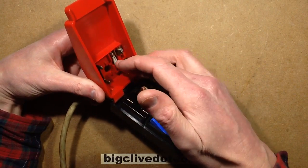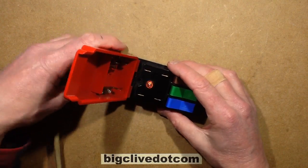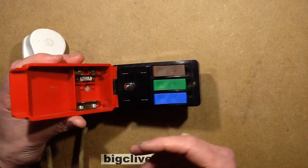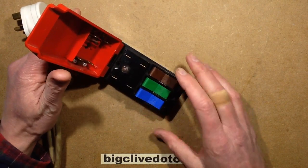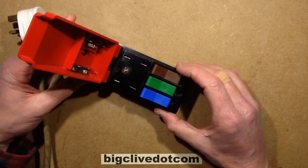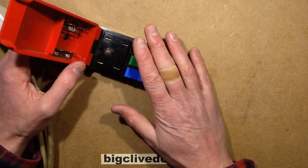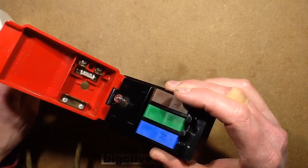The fuse being in here means that if you're plugged into a European socket that doesn't have a fuse in the socket, you've got at least a localised fuse. In the case of Britain, we'd typically have a 13 amp plug, but it would let us put a 3 amp fuse in there if we wanted. Another place these are often used - more common in the past - was television workshops where televisions had live chassis. They'd have this on the bench screwed down, connected to an isolation transformer, so anything that needed to be isolated to work on safely, with no reference to earth, they could just put into this. Anyway, I've unplugged it now, so let's take a look inside.